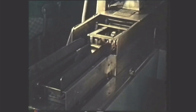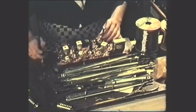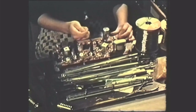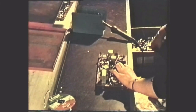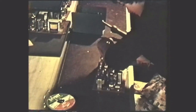The resulting panel is tidy and very reliable. The quality of the soldering is examined and two strengthening strips are added to give the panel a means for attaching it to the frame. The trays on the conveyors are painted in different colours which enables the operators to identify quickly the particular sub-assembly they require. A final inspection of the panel and all the components which have been added to it, both automatically and manually, is made before the addition of valves which completes the unit.